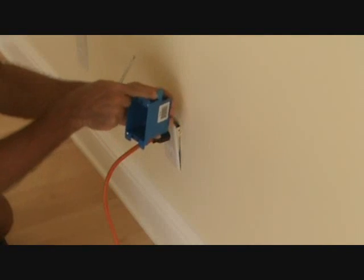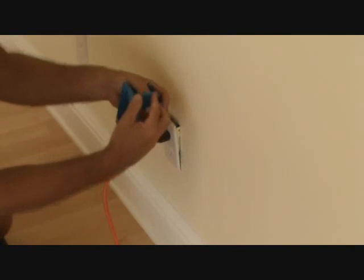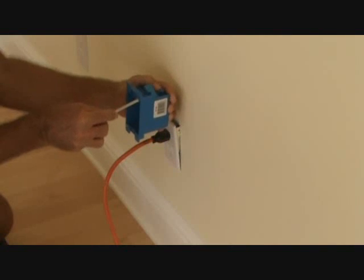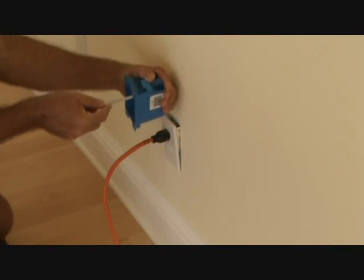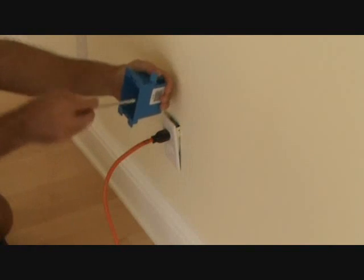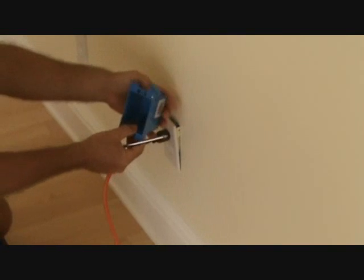What I think is happening is either this flap was too close up against the sheetrock. The sheetrock is five-eighths, let's say. And if you only have that a half inch or a sixteenth less than five-eighths, when you go to flip this up like that, you might think it's on the backside of the sheetrock. But maybe you've only got it up that high and it's not going in all the way. You tighten this screw up all the way, think it's tight, and don't know what else to do — because this flap is not on the backside. Now, that flap could've fallen off too, and we're going to pull this apart and see what happens.